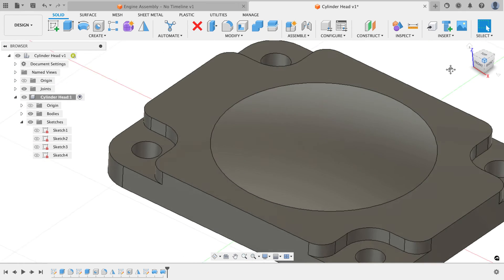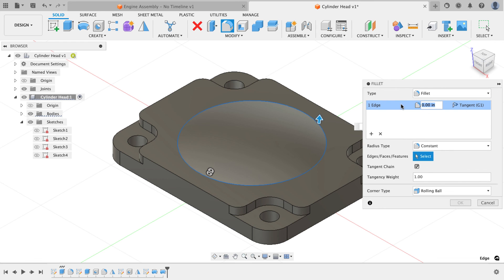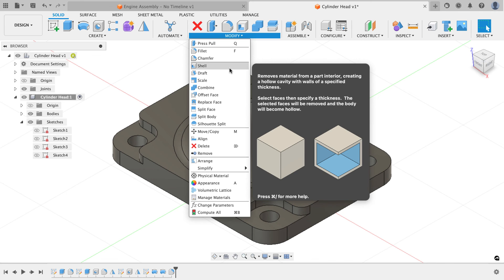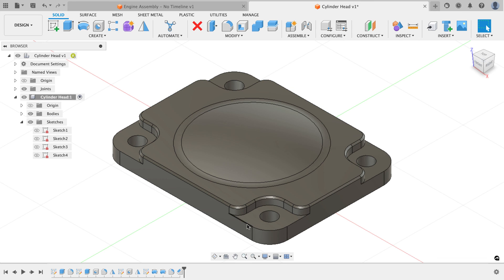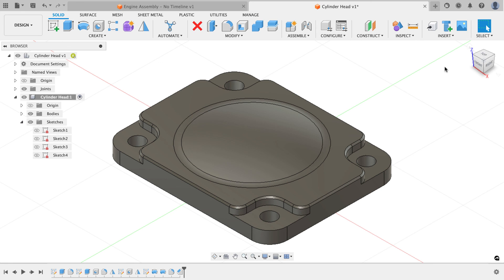On the print there's a half-inch radius where the dome circle meets the flat face, so I'll use the fillet command on that edge with a radius of 0.5. There's also a note to chamfer all around; I'll apply a chamfer of 0.02 to the very top edge chain. For the bottom edge, I'll leave it square for now and use CAM to chamfer it, which makes the toolpath setup easier. That's the full process for modeling the cylinder head. If you have questions, leave them in the comments. If you found this useful, please hit like and subscribe, and thanks for watching.